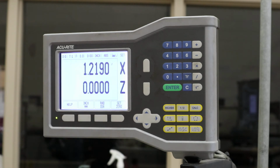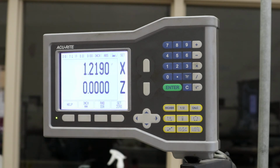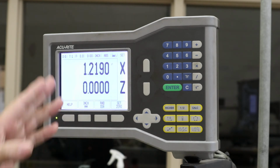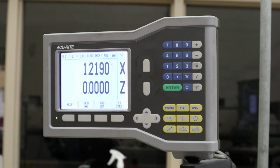That's because of tool pressure, depending on how sharp or dull your tool is, how far your compound slide is hanging out and flexing, the type of material you're cutting. That tool pressure just kind of pushes the tool away from the material. And so what I found is that it takes about 3 times of measure, plug it in, cut, measure, adjust.